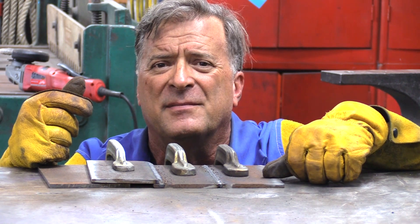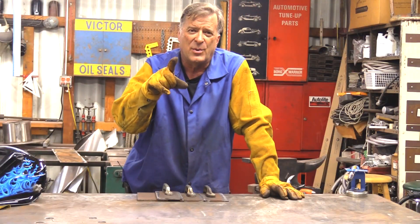Tack them in there. Tack them in there. The lap joint is obviously going to take more metal — you're going to need more wire feed really. A bit of a weave back and forth just to make sure I'm getting both edges nice. You've got your basic butt joint here and you've got a lap joint over here.